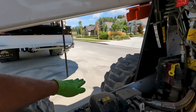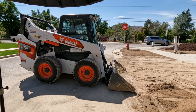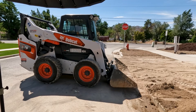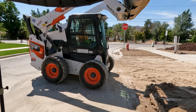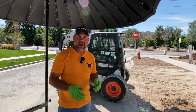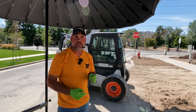Let's see if I can at least get the arms up in the air — that gives me a little more room to get in and work. On the R-series there's quite a bit of room inside where you can fit in and work from the side. Now I can raise the arms and drive it forward and backwards. As you can see, unplugging that sensor allowed me to operate the machine — get the arms in the air and even drive it. If you're in a bad situation and need to move it or get it loaded on a trailer, you can unplug that swash plate sensor and get it to move.